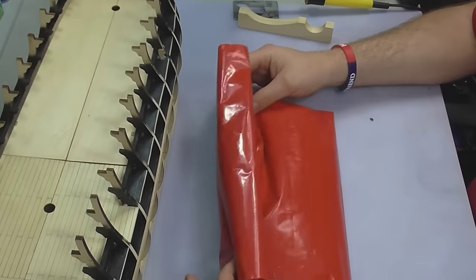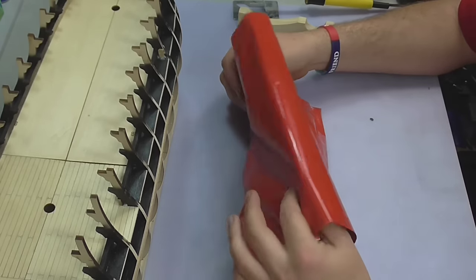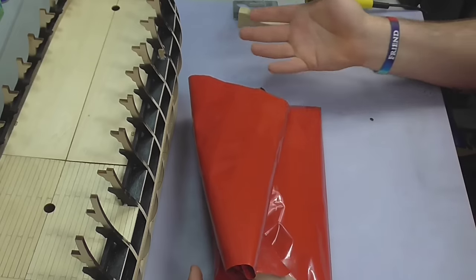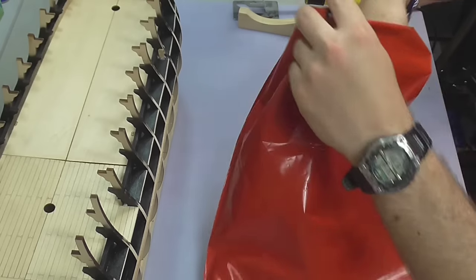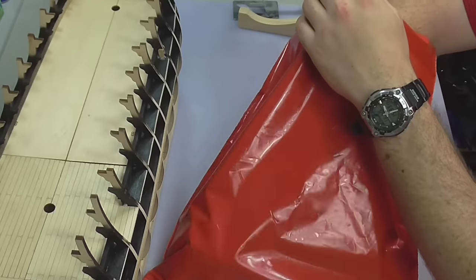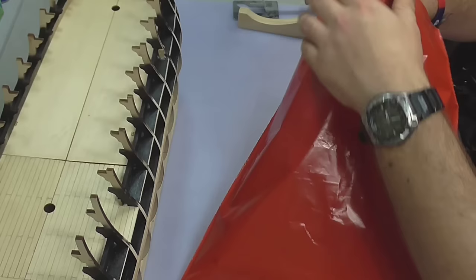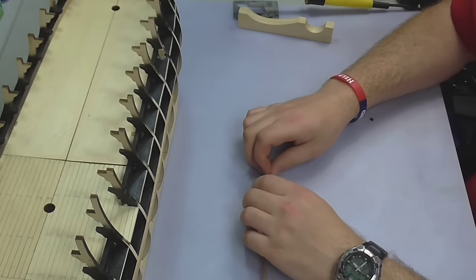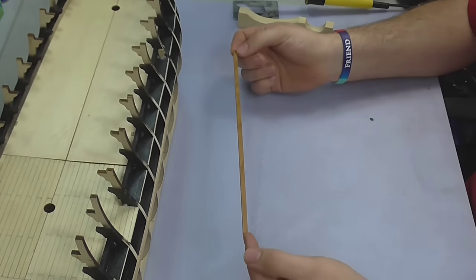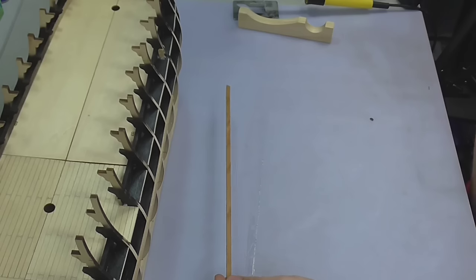What we want to do now is start looking at bending some planks. I've got a little bag — you could use any kind of container that can hold water, but I'm just using a bag at the moment. In this bag is water, and I've been leaving the planks to soak in here for about half an hour. You can leave them overnight if you want, but basically you just want to get them soaking up a nice bit of water for about that half-hour mark.